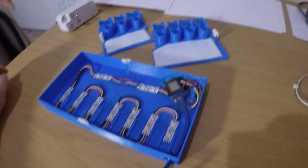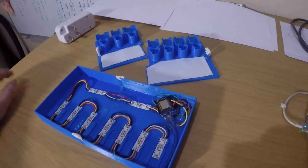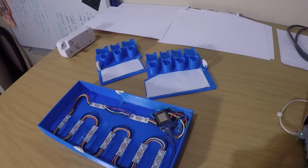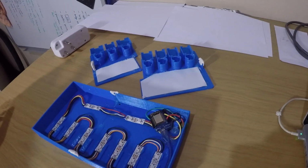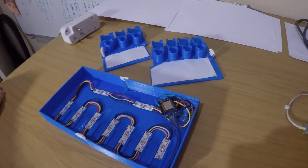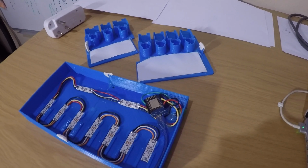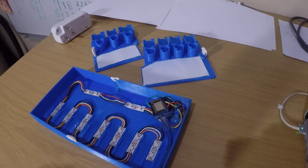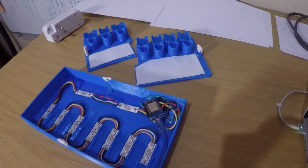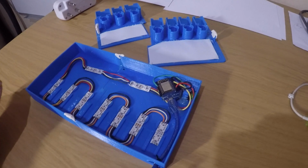So how this thing works is that every hour I'm checking with an Azure function if there's a new run, if I've done some runs, doing a call to their API to get some running information, and then I'm just changing that into LEDs, an array of LEDs, and then I send that down to this device through the ESP.